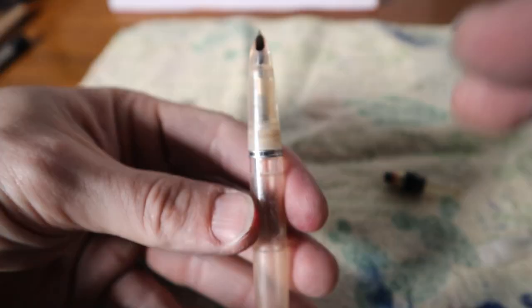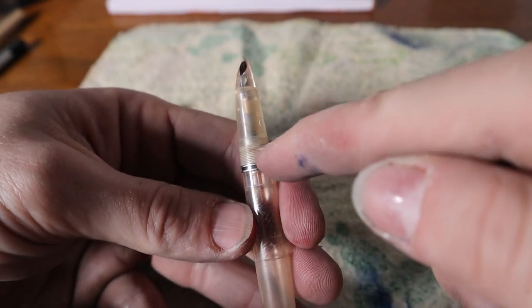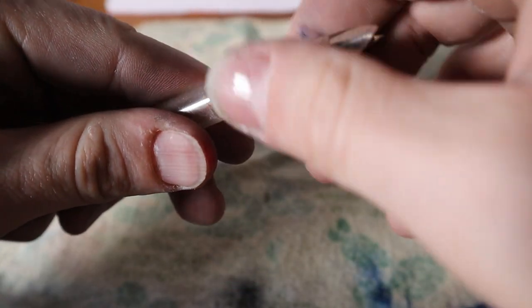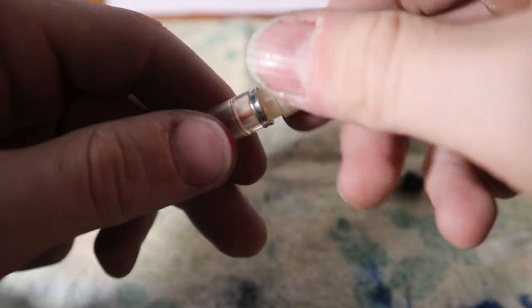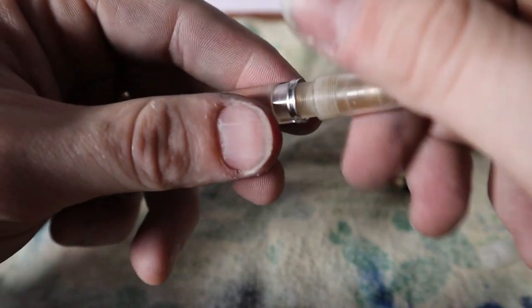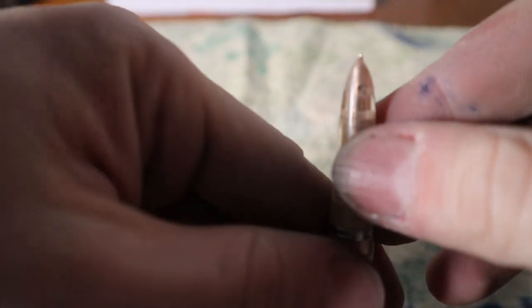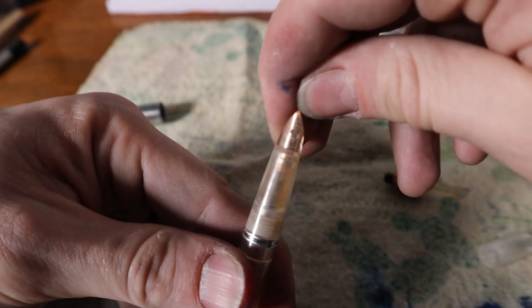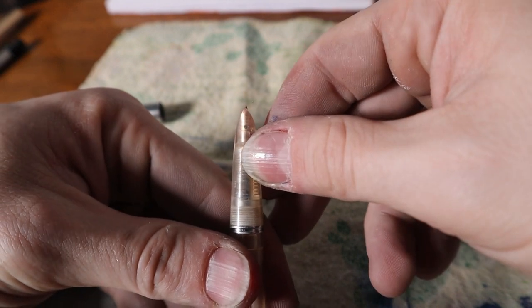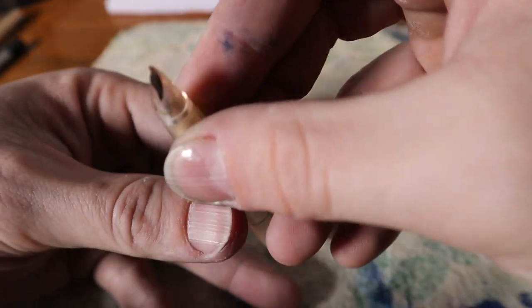And rather than, you know, put some adhesive or shellac that's going to discolor, I think what I'm going to do is just put a little silicone grease right there just to make sure we have a nice airtight seal, because I really do think I'm going to come back to it and try to re-clarify that. So actually, since I don't have my silicone next to me, I will just leave this here. Take it back. Did it stay? I must have touched it a little bit because it's a little bit off. That's pretty good. I'll come back and fiddle with it. Since I'm going to come back in here and put some grease on it, I'll fiddle with it a little bit more.